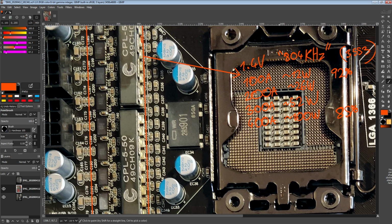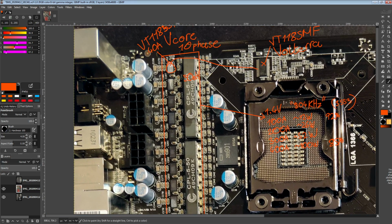That's the thing, 70 watts of heat coming off of a VRM sounds terrible, and it is. Honestly, you can design VRMs that do a much better job of not producing that much heat for that much current output. Just look at any modern high-end GPU or modern high-end motherboard. And this board was high-end at the time. Volterra literally doesn't support more than 10-phase configurations. And now that I think about it, you probably couldn't do the whole Asus put 2 power stages in 1 phase thing, because these are smart slaves. That would definitely not work.